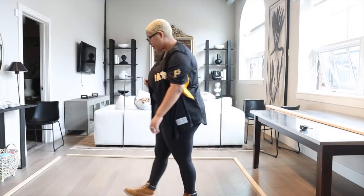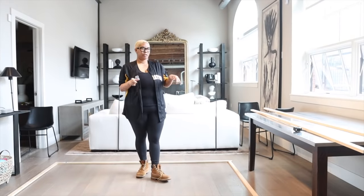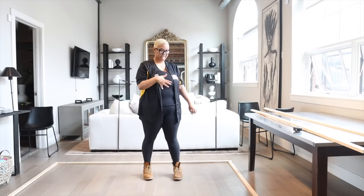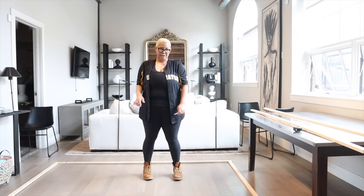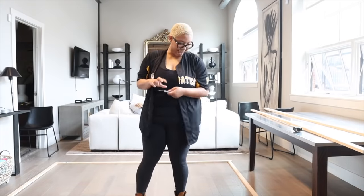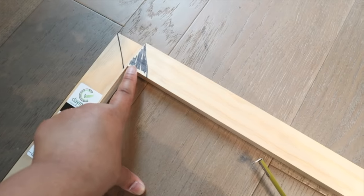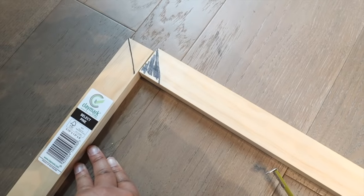You're always welcome to message me if you have any questions. I looked at all six pieces of wood and chose the absolute flattest ones to go around the base, because you don't want any bowing — which happened in my other one. Now I'm going to mark where I want my 45-degree angles. I got my handy Sharpie and drew what the cut would look like — the black representing dead space — then measured that space and got to cutting.